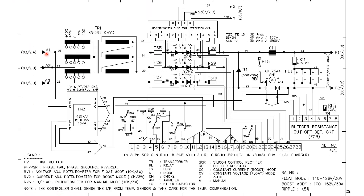We have reached A1, A2, and A3 — this is the supply going inside the transformer. This is a boost transformer, so voltage transformation will be from 440 volt AC to 150 volts. In boost charging mode, we want higher voltage levels to charge the batteries. This 150 volts goes into the SCR circuit, and after rectification we get DC 110 volts going towards the battery charging.